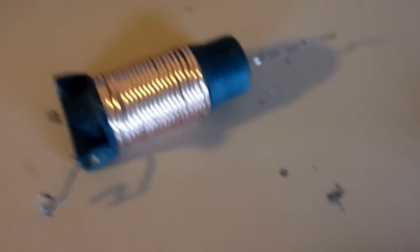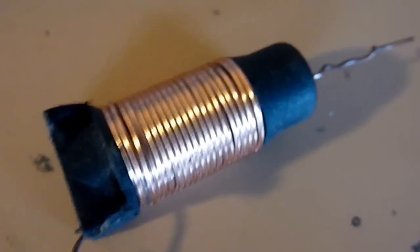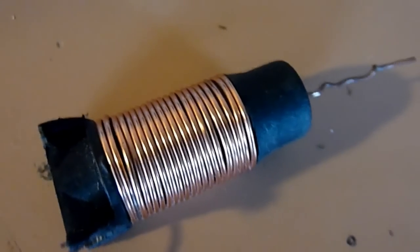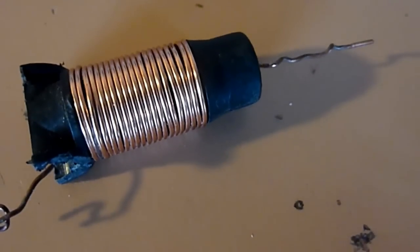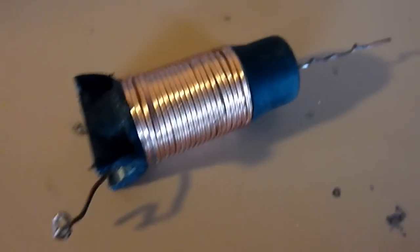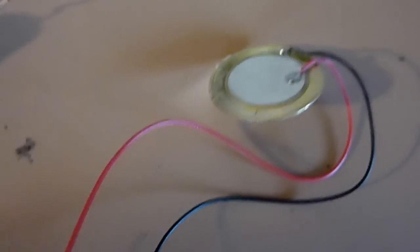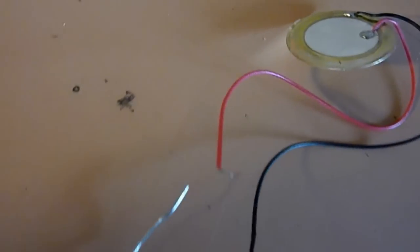You get a really scratchy sound right up in the top end on these, but with the choke it makes it roll off just enough so it sounds smooth. Rolling off means the treble becomes less intense as it goes higher, which is the opposite of what these piezo units do — so it cancels out to a nice, even sound. It sounds like a tube amp rather than a static-y sound, and that makes all the difference.